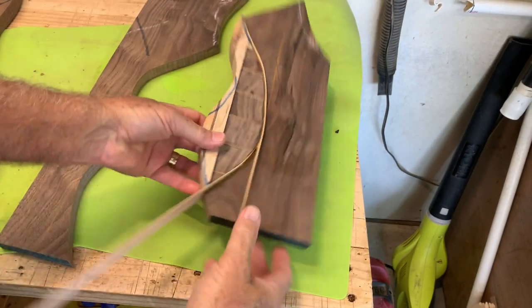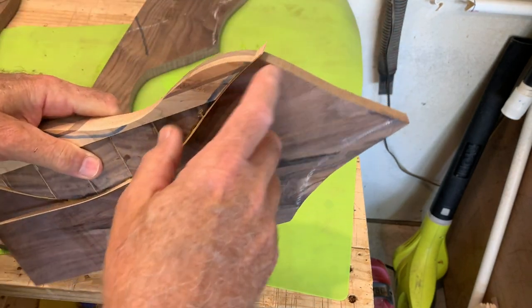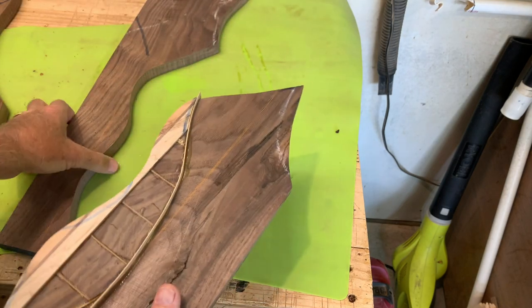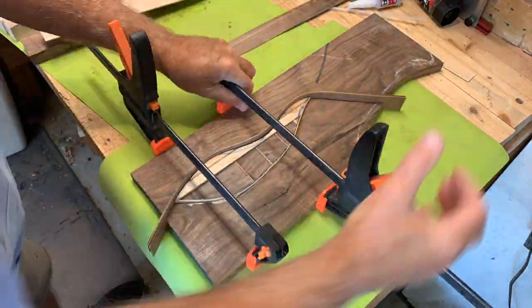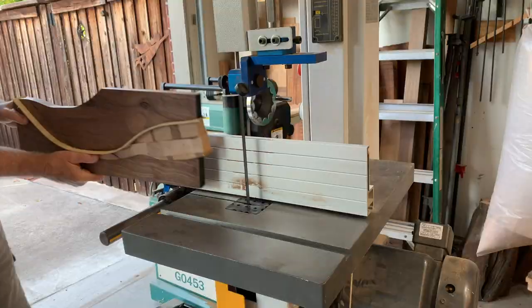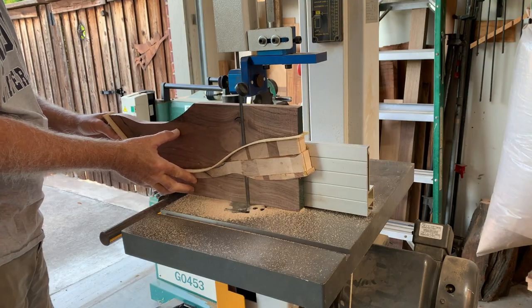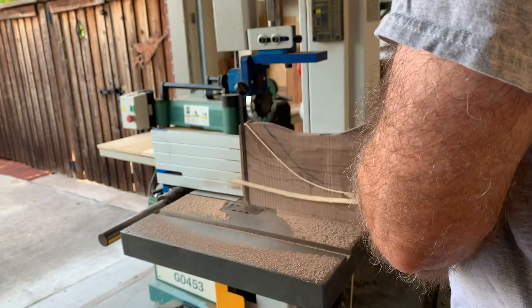I took this piece out of the clamp and we have a little bit of veneer hanging out of the end — I'll trim those off and then worry about gluing up the next piece. This piece is going to fit in kind of like that. Here's a sample of doing a dry fit clamp-up — it's important to do that to make sure your spacer boards in between are going to flex and fit into the area you want. After the glue-up of the first board I take it to the bandsaw and saw off the extra length so I can continue to work on the next piece.